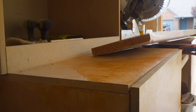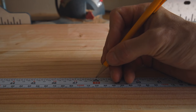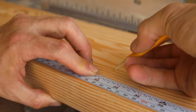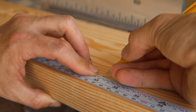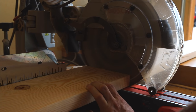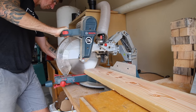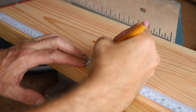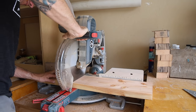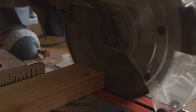The rockers for this chair are made out of a 2x12. I measured out 48 inches, marked a line, and then cut this board on my miter saw. Next up are the armrests which are 33 inches long — I cut down two of these from a 2x8 board. The two lower armrest supports are both 31 inches, also cut from a 2x8. Then using the remaining 2x8 offcuts we're going to cut four of these 12 and a half inch armrest supports. Moving on to the 2x4s, I cut three lower cross supports at 37 inches.